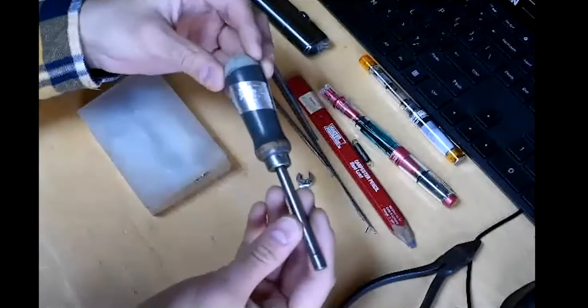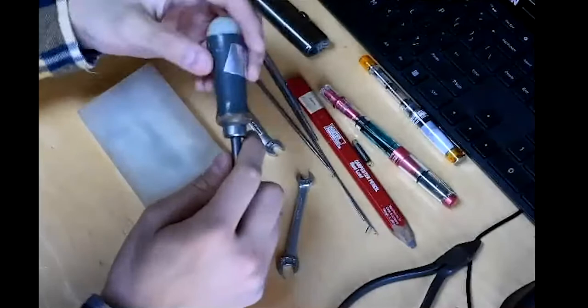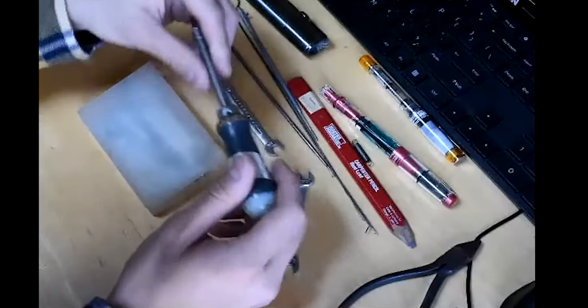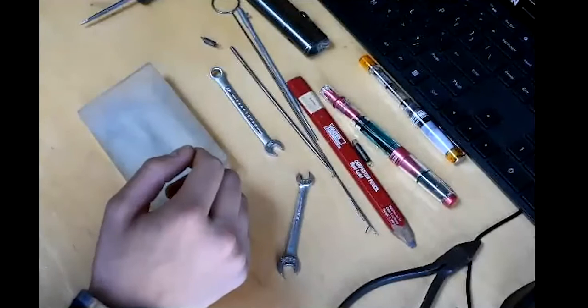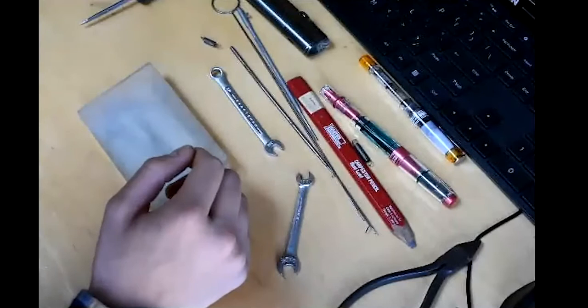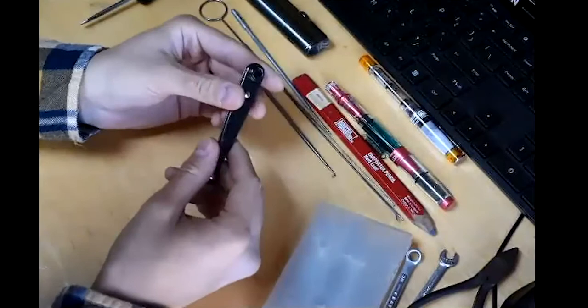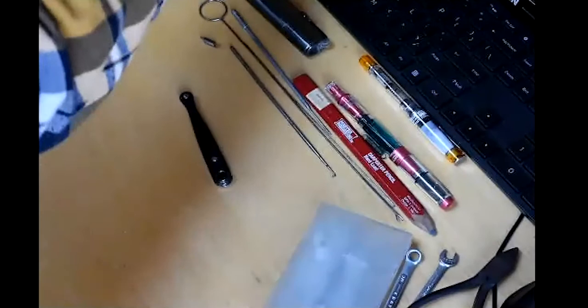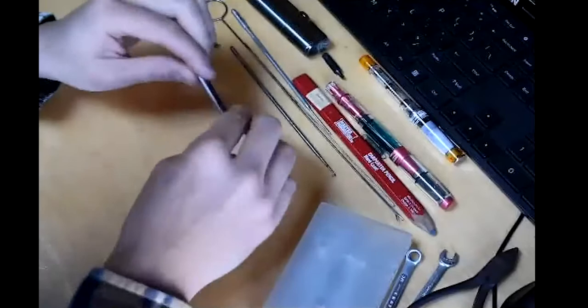In relation to wrenches, I highly recommend socket screwdrivers. This is a fixed hex screwdriver sized specifically for the Royal Model P and all Royal portables — for the lock nut on the shift adjustments. The nuts on Royals are the same size as those on Smith Coronas and Remingtons, so you get great use from just one tool. The Chapman typewriter tool set also includes a mini ratchet — a standard quarter-inch socket, not reversible but super handy for getting into really tight angled spots.